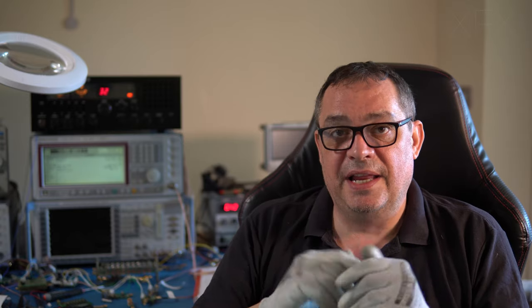And you've got to pay attention to keep the linearity. There's obviously a bit of work in the circuit board development. They use strip line, so we get nice balanced capacitive and inductive rejection, so it just stays nice and linear. I've tested a lot of these modules on my test equipment, on the analyzers, and they're as good as gold, especially for what I need them for.